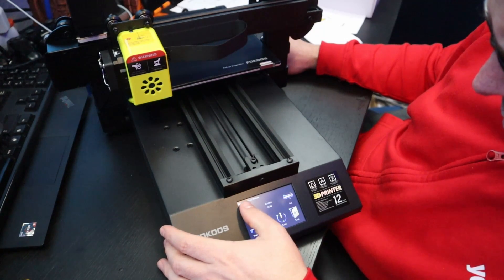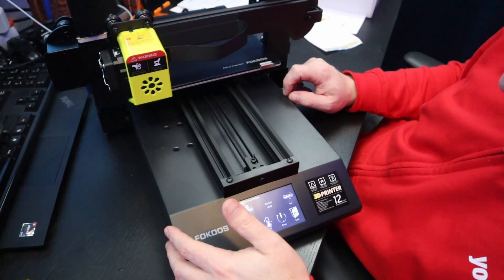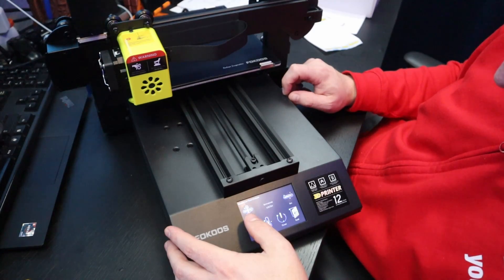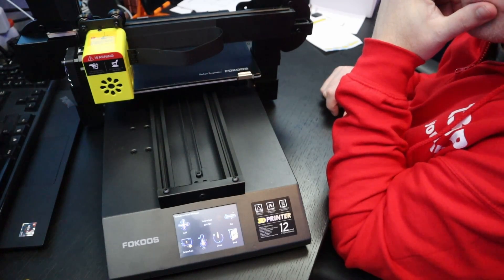I started heating up the 3D printer to load filament and start my first print. During the bed heating I noticed something: the thermistor didn't register any temperature increase — I still saw 23–24 degrees Celsius and the bed stayed cold even after two or three minutes. Something was wrong. I flipped the printer over, took the cover off, and looked at the main board. I couldn't see anything obvious, but there was a slight smell and some discoloration on the SD card slot.